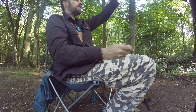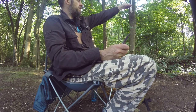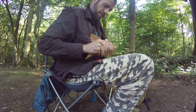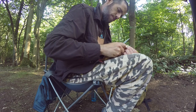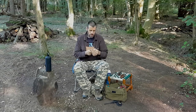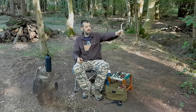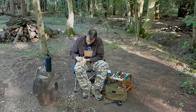I'm just cleaning up the outside shape of the bowl now, holding it up against the contrasting surface. There's a big oak tree in line with my eyesight here, so if I hold it up against that and just shut one eye, it helps me visualise where there's bits of wood that want to come off. Take a bit off, check again. I'm aiming for some fairly symmetrical curves — it'll probably end up slightly asymmetrical because I'm not a machine, but I'm going to try. Look at the front and from the back. If you've kept these sides of the rim upright, you shouldn't see too much discrepancy between the front view and the back view. Sometimes it can just be that you've cut at a bit of an angle so the back looks different to the front.